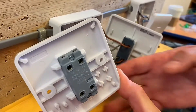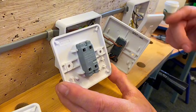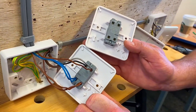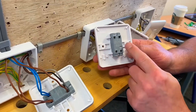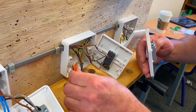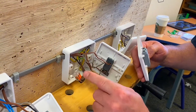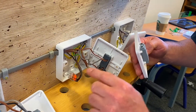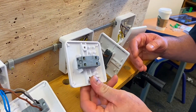There is no additional terminal where I could put these two, so that was a bit of a letdown when I bought it - I was expecting to have an extra terminal. If you look at these two switches, they use remarkably the same frame, so you'd expect the intermediate switch to also have that loop terminal, but when we get to the intermediate switch they haven't included an additional section for those connections, which have to stay in my Wago 221. That was a little bit disappointing. If you've been using the Hager one and the Hager intermediate switch has an extra connection, please leave a comment below and I'll perhaps buy and investigate that. The Schneider intermediate switch had no additional terminal - what a shame.